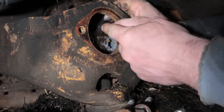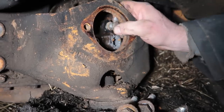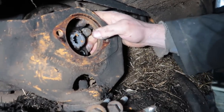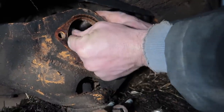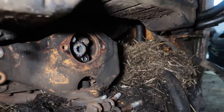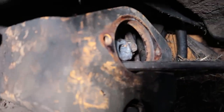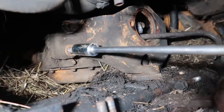So many comments about why I didn't lube up the bolt — because I don't want those to fall out. I put it at proper torque, which is tight — which is when my elbow clicks. Tighten all four and then put the mount back on and see if that does it. The longer bolts go in the coupler; the shorter bolts, even though they're the same thread, hold the pump in place. Good idea to get new lock washers for the drive at the same time.